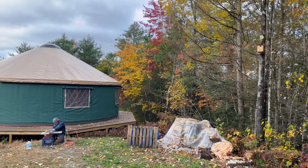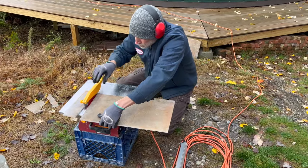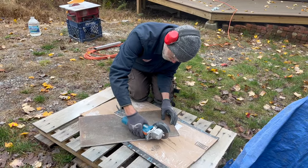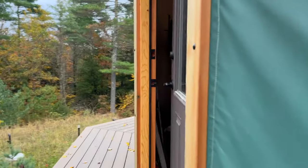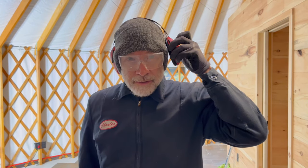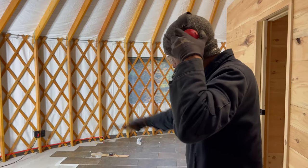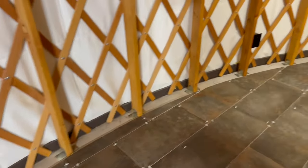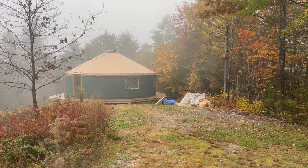The trailer was taking up a lot of valuable real estate that will eventually become a woodshed, and when that happens this pile of firewood will be a lot more pleasing to the eye. For now, Charles is back at work on the tile — cutting and laying it out from the utility closet outward into the bedroom and beyond. He's made quite a dent in the stack of tiles on the pallet. The tile can be mocked up and cut on colder days, but laying and grouting have to wait on the weather since both the mortar and grout have to cure above 50 degrees Fahrenheit.